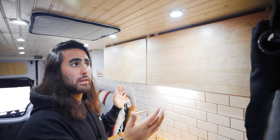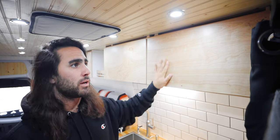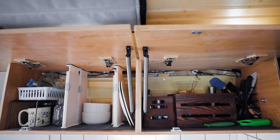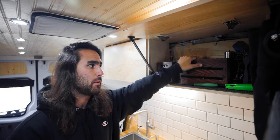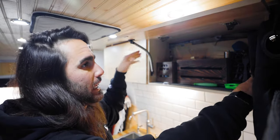All of the cabinets in the van were completely hand built — probably the hardest part of the build because of getting the fit right and the doors to line up. All the cabinets are made out of half-inch birch plywood, and I ended up just staining it with some polyurethane, but I like the natural Scandinavian look that the birch had. This first cabinet up here has cooking stuff: spices, olive oil, all my coffee stuff, and other cooking utensils — everything I need right above the stove for easy access.